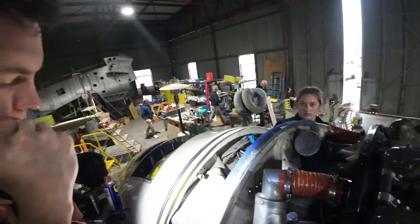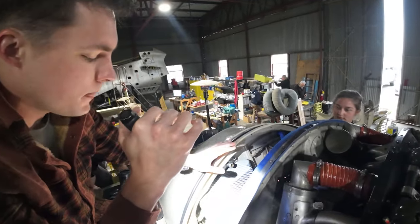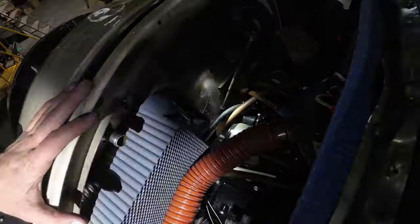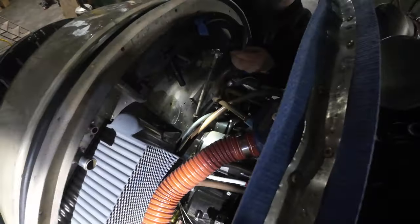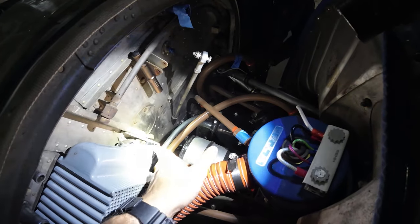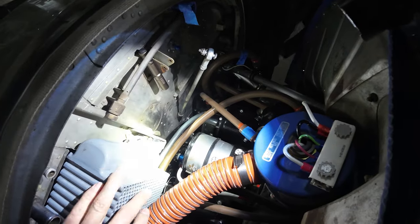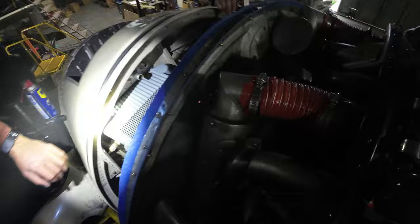What are we doing with the oil cooler? So we're mounting it for final installation. We put bolts and nuts in it already. However, the washers weren't fat enough, so they rotate. The shanks are too long. So, if you push it, these bolts here need to have a feeler gauge between the wall because you can't get a socket on them. So that's just making this tedious, but we'll get it done and we'll have an oil cooler installed.